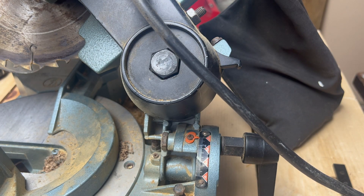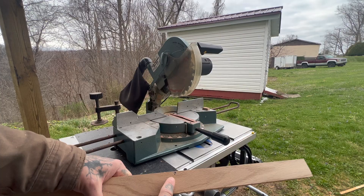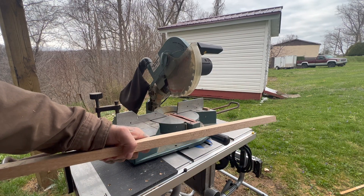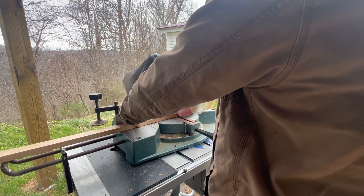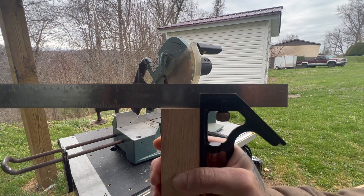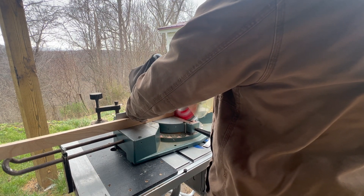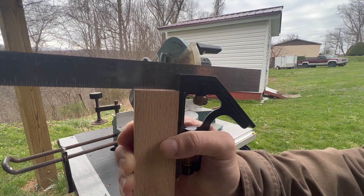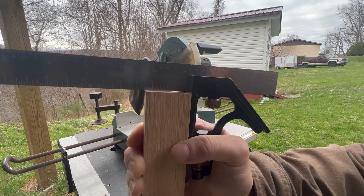All right, that's not going anywhere. Now we're going to test it out. I've got a little arrow — I'll try it against the fence to make sure the bevel's at the right angle, then against the fence the other way to make sure the miter's at the right angle. That's pretty darn good — about a 30-second or 64th off, but that's within an acceptable margin of error.